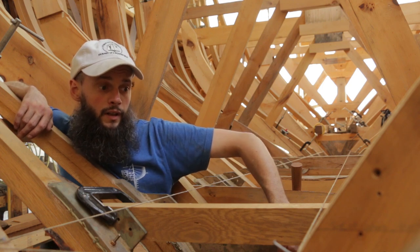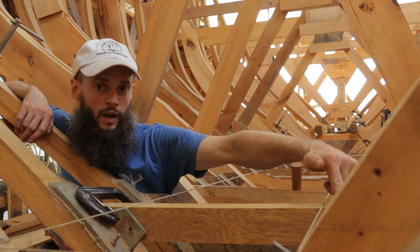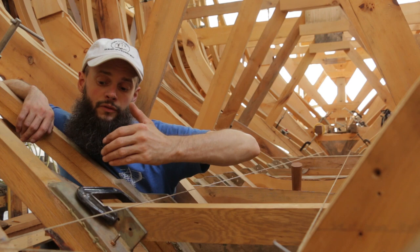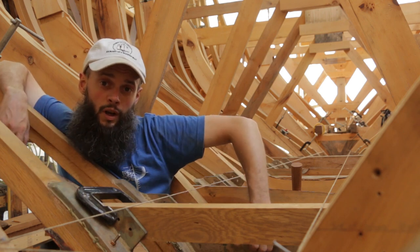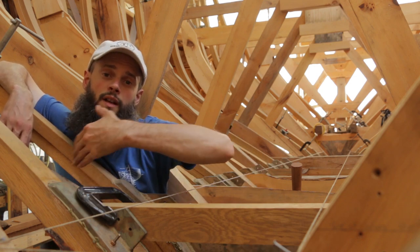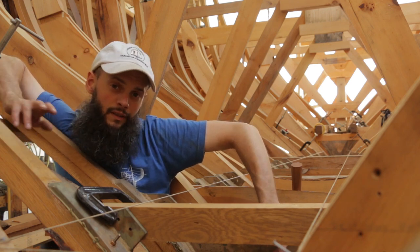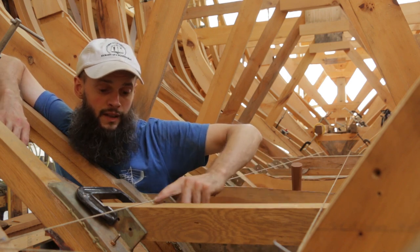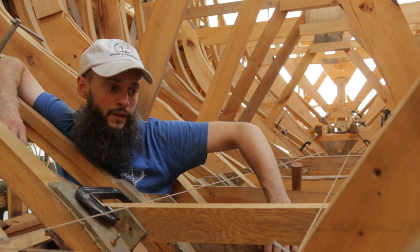And then once that was done, we'd come through and decide whether or not we needed to inlay where the bronze was a little bit so it would sit tight to the frames, or depending on if it was fore or aft on the frame, or depending on how much the frame twisted at which station it was, we might need to do a little bit of letting in on the outside edge so that it sits in touch, flush and tight to the frame. Each one of them was their own little different problem. And a couple of them, like this one, sat really close to flat on the top, so close that they're not really worth messing with.